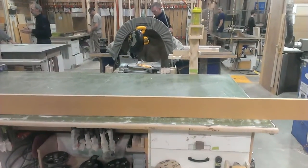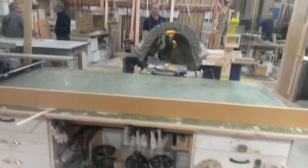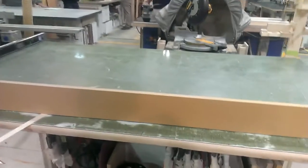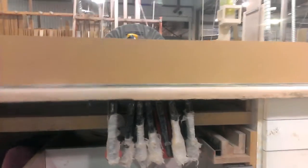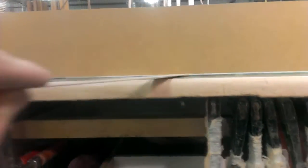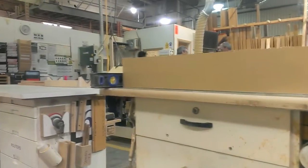Hi, Jason Nisle here from Specialty. I just want to make an improvement to my table. The tabletop itself could probably use a replacement after a bit, but even if I do that right now I have a more primary problem which is that the base isn't very level and it causes the tabletop itself to sag. Here I have almost an eighth of an inch in the middle and then tight at the end. So I'm going to try to improve that.